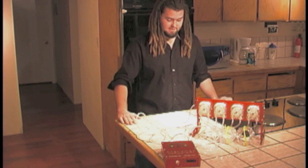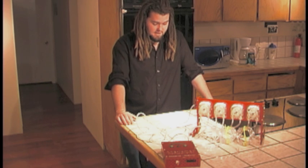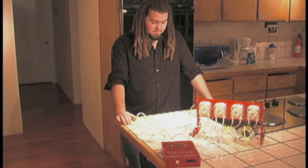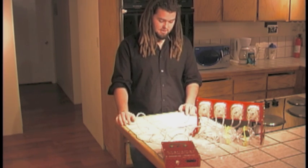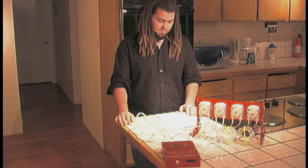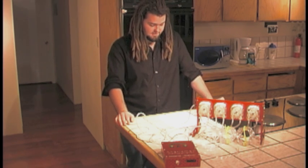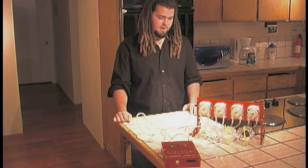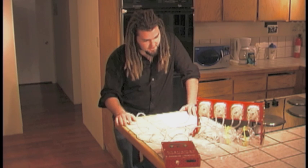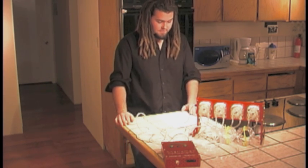The calibration process itself is very straightforward and should be done at all three levels for 25, 50, and 100 milliliters. Each pump must be calibrated separately with the nutrient it is to be used with. Simply pump the nutrient into the graduated cup and measure the amount dispensed. If the nutrient is higher or lower, then use the control to simply adjust. Once done, move on to the next pump and continue. And these are really accurate, hospital grade. They run at 350 milliliters a minute, each pump.